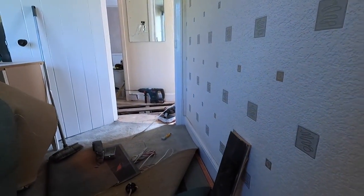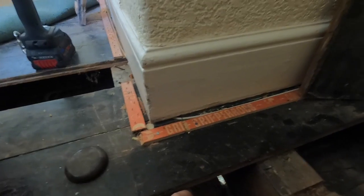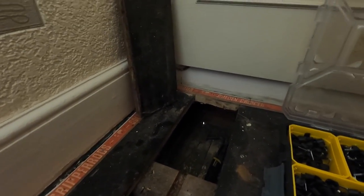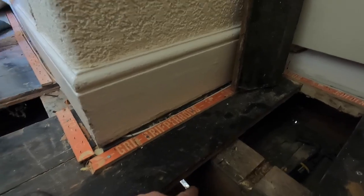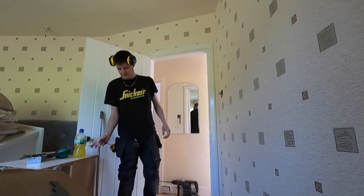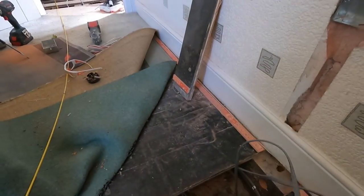There's a three-core coming up - we've got a little fire clip in there. Cut this board flush, we'll put a brace in afterwards - a piece of wood that's longer, put it underneath, few screws, board can sit on top and screw that down. Fire clip there, just doubled over the cable with a bend in it, and that's going straight down to our light switch in the hall. That's our hall light, that's our hall switch. Now I'm going to drop a three-core from here up to the landing switch, and then there'll be a two-core from the landing switch going to the landing light.